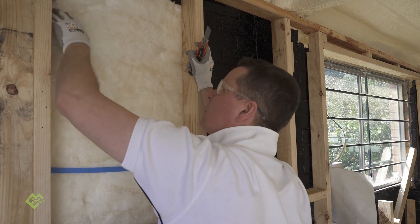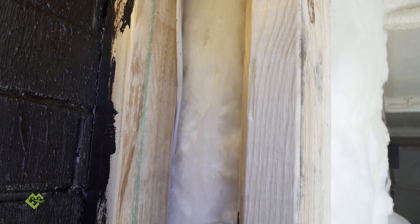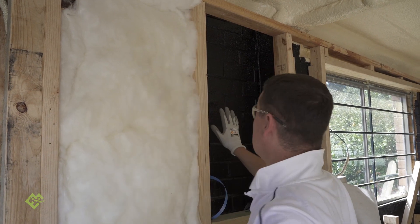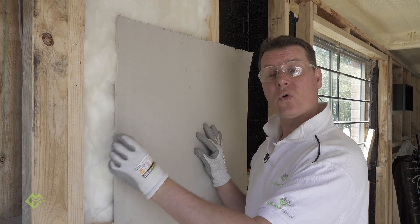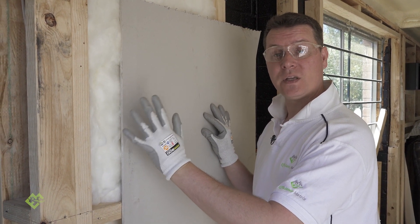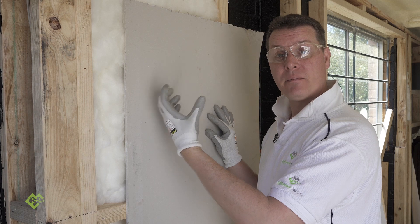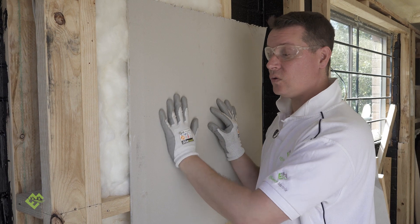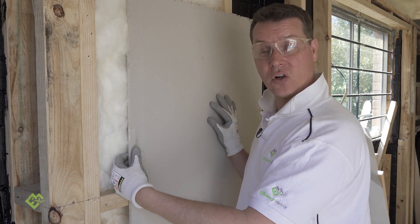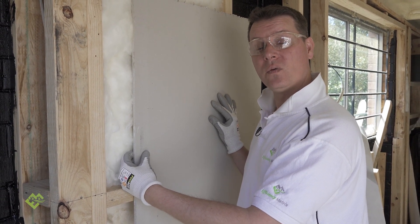In this particular situation, we're going to have insulation installed for the whole wall system — the cavity behind the wall backed up against a bitumen membrane, and then all the way up to the plaster. It's really important for building performance that all the nooks and crannies are absolutely jam-packed with insulation and you don't have compression. If you're using insulation directly abutted to a bare brick wall on the backside, make sure the insulation is not in contact with the bricks. Once it's plastered, ensure that insulation is as close as possible to the gyprock — get that right and you'll have a really well-performing wall system.